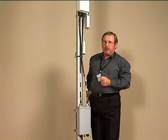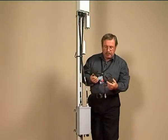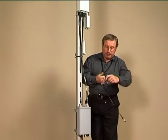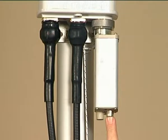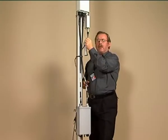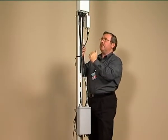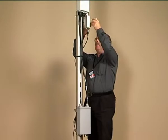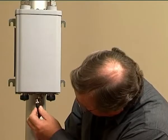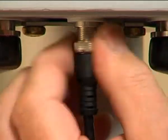The next stage is to connect the control cable to the antenna system controller so that we can actually control the antenna tilt. Remove the protective cap from the control cable connector and fit the control cable. Remember that all of these joints still have to be waterproofed, and also don't forget to remove the plastic cap. You can't leave that dangling in the wind. The other end of the RET control cable is connected to the data output from the ASC. The data cable is connected.